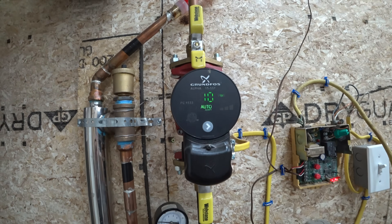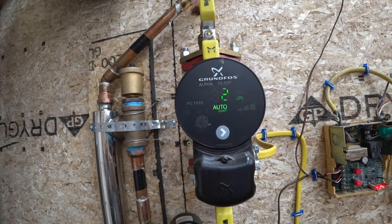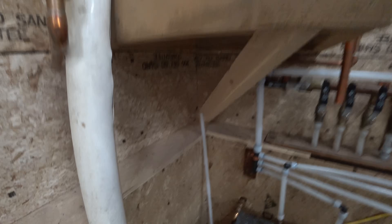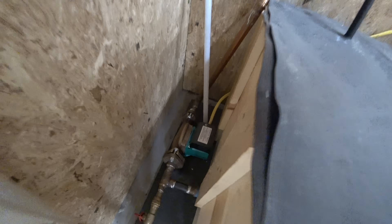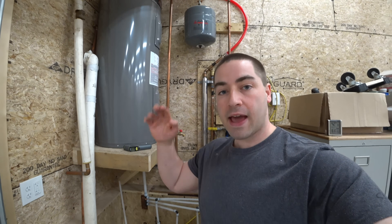This is pumping 10 watts at 2 gallons per minute. This is going through the radiant floor, through the concrete, and through the heat exchangers. I don't have a flow meter on it, however I've checked the graph from the manufacturer for that little brass pump, and at the head that I'm pumping, that should be moving at 5 gallons per minute.